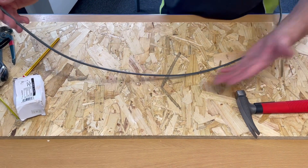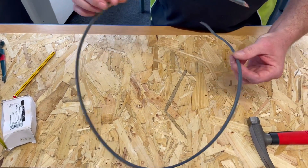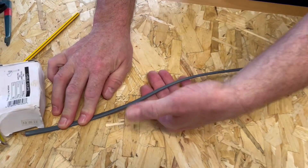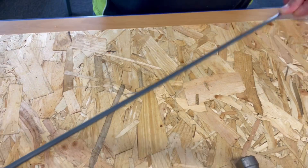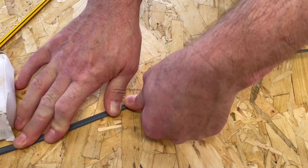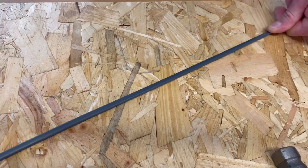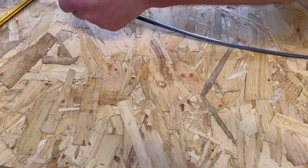In order to do that we're going to use some of the skills we did before. If you're taking a piece of cable from college - it might come off a drum, it might be second hand - we're going to get it flat: four fingers underneath, thumb on the top, and drag it against the surface. We do this many times as shown in the previous video so we can get it flat to the surface.